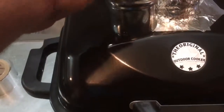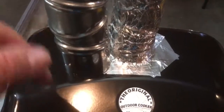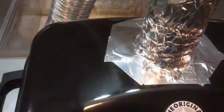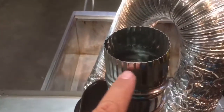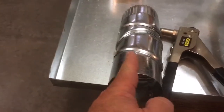The bottom holes are going to be the air intake — air comes in and up through the smoker and then out the chimney. The chimney I made from a piece of stove pipe. I basically drew a line around the bottom, drilled some holes into the lid, and cut it out with a Dremel tool. You want to keep the crimped edge facing up because that makes it easier to put the aluminum dryer vent tubing on.